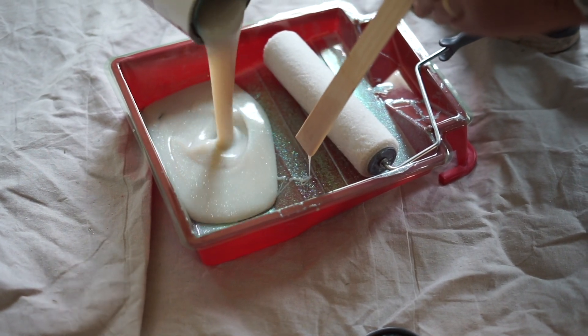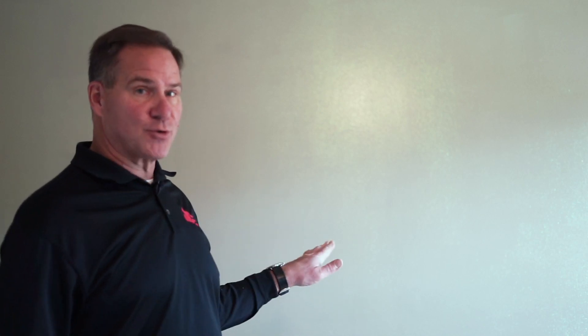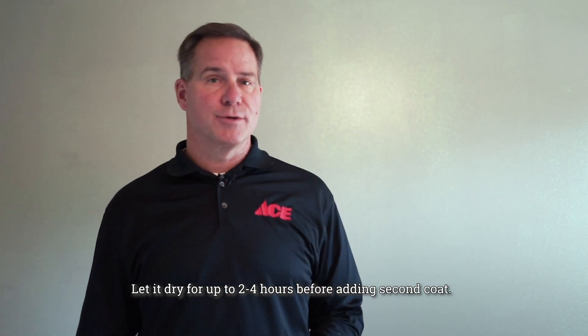We're going to do a second coat using a second quart of the paint. As you can see, there are some vertical lines based on how I applied the material onto the wall. I'm going to come back after this dries with the second coat going horizontally to blend it all in. A lot of people just take glitter and add it to paint — while you can do that, there's a lot more expertise involved to get these kind of results. With paint that's designed to do that, that goopier, thicker material is what gives you these results.